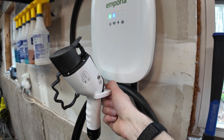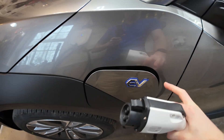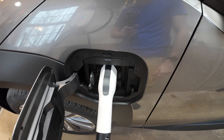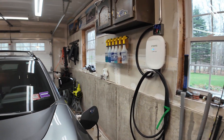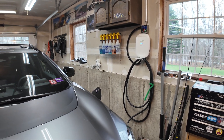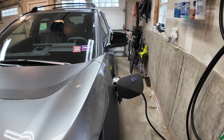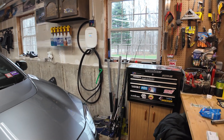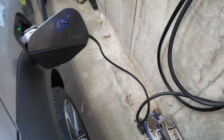The charger itself comes with a nice sturdy, feels-like-metal arm. It lifts up. On the Subaru the charge port doors push open — it's a nice lighted bay. Plugs right in. In the app I can see it's pulling 7,200 watts where I have it limited to 32 amps. I'm not sure if that's the car keeping it from hitting 7,400 watts, which would be the full 32 amps. We've been keeping it so topped up that the battery is always around 88 to 90 percent when we plug in, so I'd imagine if I was closer to 20 or 30 percent it might actually draw more wattage. The cord that this comes with is really stiff — that part is not too fun.